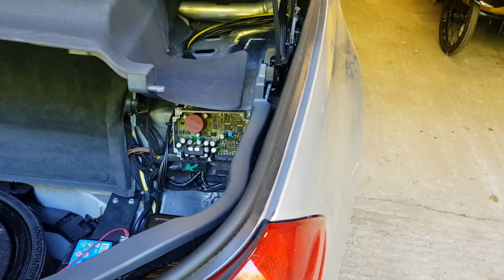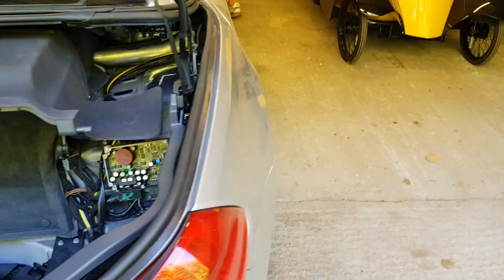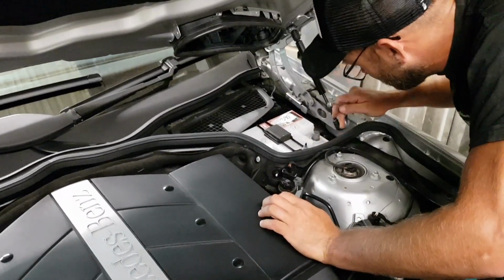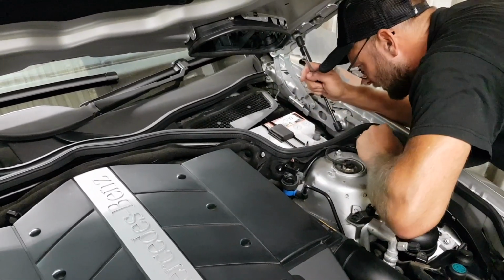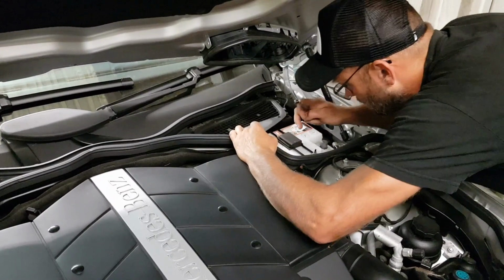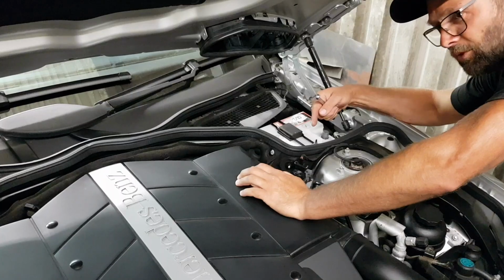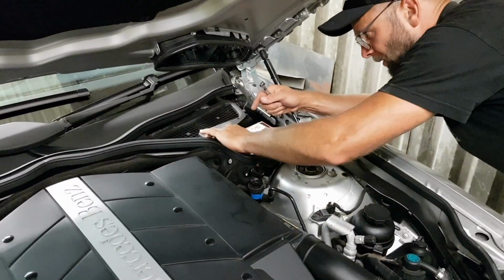Right, connect the starter battery. Sorry, carry on. Right, so you're just connecting up the starter battery now. I looked up online, and the starter battery needs to be connected first, and then the consumer battery. So does that put power on the back as soon as you connect that? Well, the box that you've repaired is what controls the charging between the front and rear battery. So as soon as you connect, we'll have power on the back. I think there will be some power.